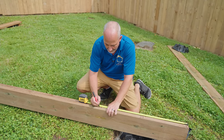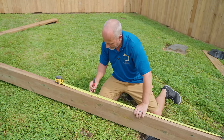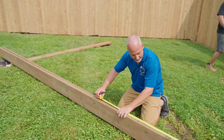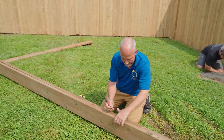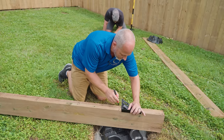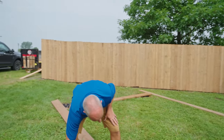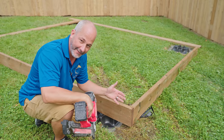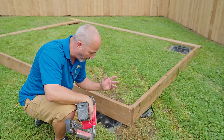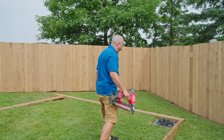Here we go, so I'm just going to mark this. The red squares on this tape are always the 16-inch centers — at four feet they're a little smaller, everywhere else they're big. Once I'm done going all the way across I'll just connect my dots, and if you want to use a square you can. Now when you're nailing anything, building code is one nail for every two inches of dimensional lumber. This is a 2x8, so there's four nails on the surface or three nails and a structural screw — either way, that's the rule you follow or you fail inspections.